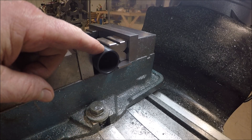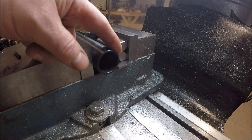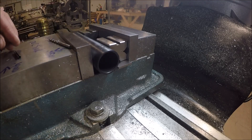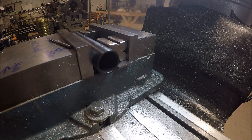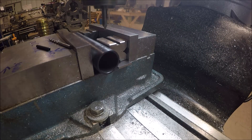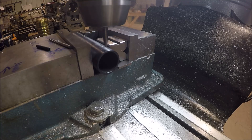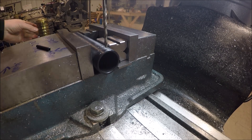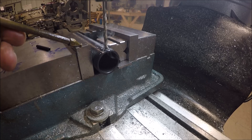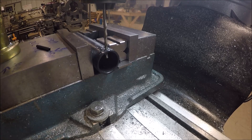I moved in 200 thou - half of the 400 thou we have to work with - and then came over to find the center which is 0.668. So we'll center drill it. I've got a 5/32nd drill bit and a 5/32nd roll pin that'll fit in there. Let's get to it. Making sure it's snug - don't want to bozo it. Wow, this is some soft stuff - that was easy. Either that or it's a super sharp bit, but I think it's just soft steel.